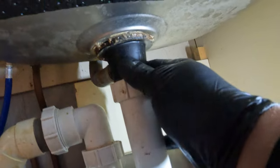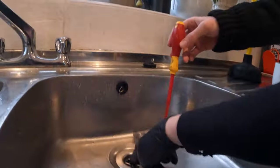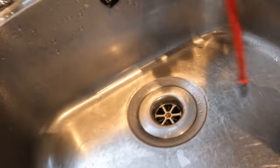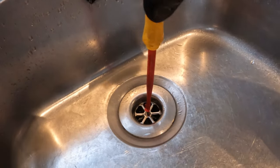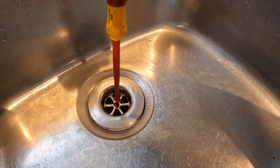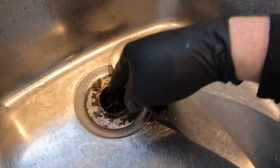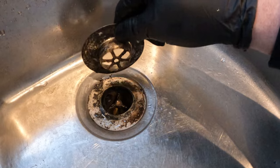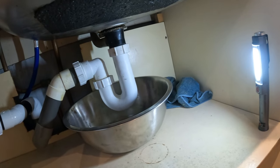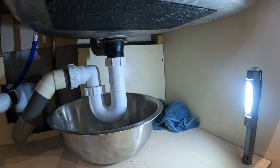So if we look at this — that is loose. We're going to tighten that up. There's a flat-head screw in the middle and all we have to do... oh no, that's broken. The screw's actually corroded. So I need to let her know about that — we need to go and get a new one, which is a sink waste with overflow, and I don't carry those so I'll have to go and get one.